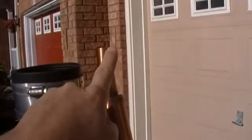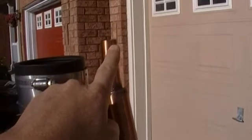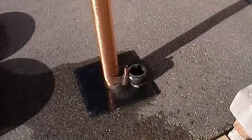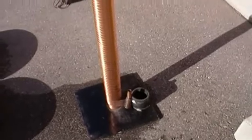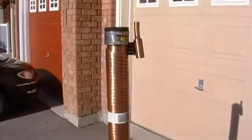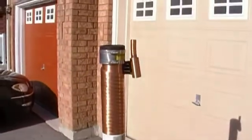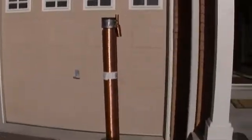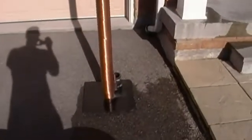The cold water picks up the heat going down the drain — the water doesn't mix, but there's a heat transfer. By the time the water comes out of the top outlet, it's warmed 10 plus degrees Celsius depending on the temperature of your shower and the size of Power Pipe you have. This one's a 60-inch. You can recover 30 to 40% of the heat that's lost down your drain when showering.